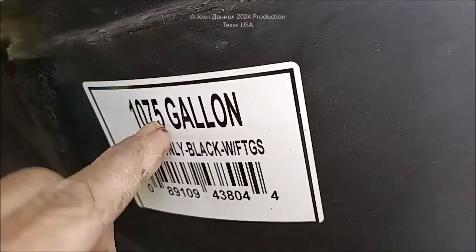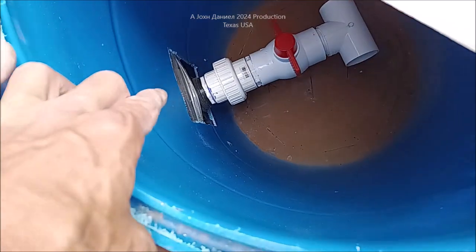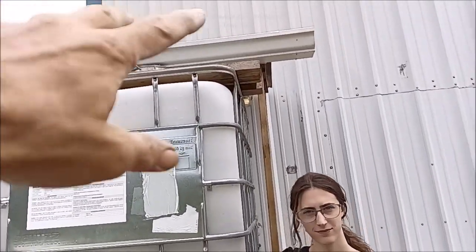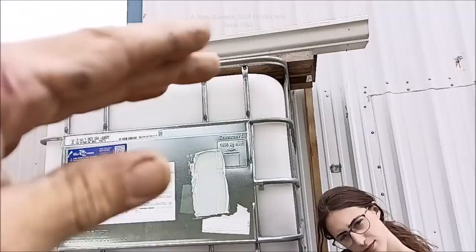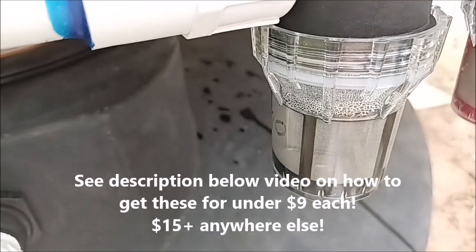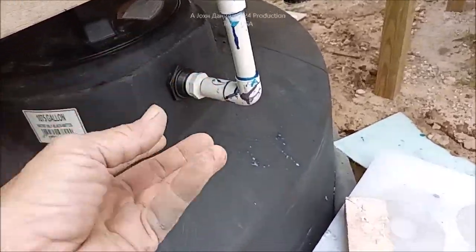This one here is a 1075 gallon and the other one is 1200 gallons - it is quite full. Down here is where all the control valves go, and there's a barrel epoxied to the tank. Rain comes down and hits the gutter - it's capped on both ends with a hole in the middle. There's a stainless steel pot with three sets of screens going all the way from 10, 20, 40, up to 80 mesh. It goes into the tank, comes through another 80 mesh, then through a 200 mesh - that's basically 70 micron. Then on the other side there's a chlorine emitter.